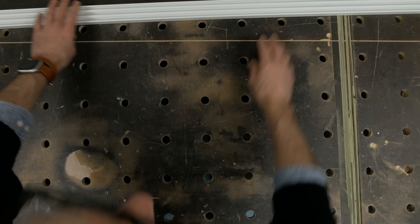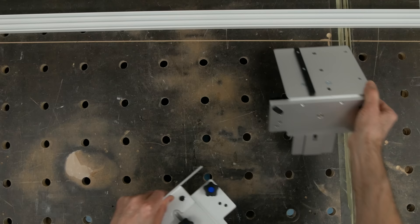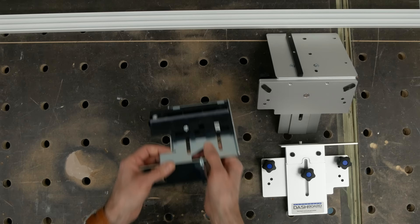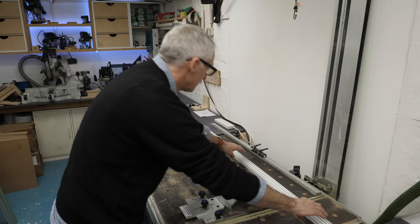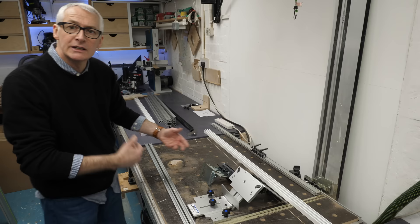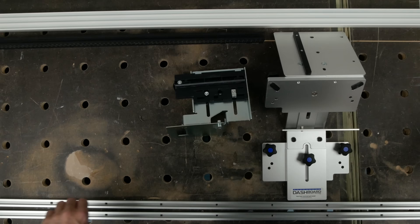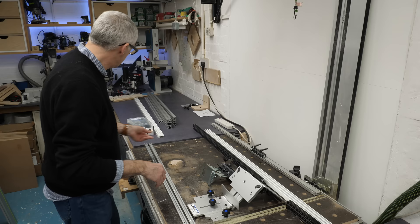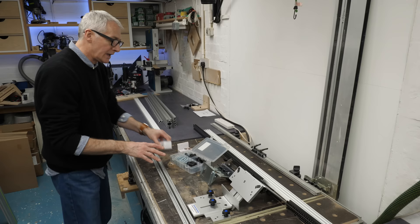So at the back of my bench I'm going to have the IKEA curtain track, because it will work with the Dashboard front and rear rail supports and will also give me the option to use the Festool one if I find the Dashboard hinge pushes the whole bench too far forwards. At the front I'm going to use regular T-track, because all it ever needs to do is hold the front rail support — which will only ever be the Dashboard one — and rail clamps, which work perfectly with it. For a fence, I'm going to use the Bench Dogs fence and right-hand side extension fence with flag stops, plus all the little bits and pieces from the Rutlands set and some spare UJK knobs and T-bolts.